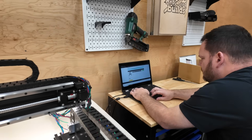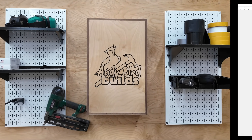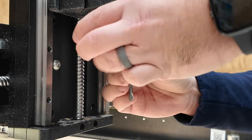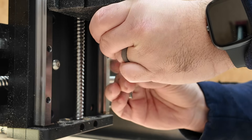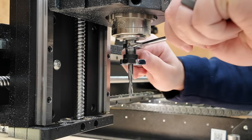Not just any double-sided tape will do — be sure to check out the material list in the description for the tape I recommend and all the other supplies I use for this project. Now let's look at the tool paths and bits. First, I've got a pocketing toolpath set to a max depth of half an inch. To keep things simple, I'm using just one bit — a quarter-inch downcut bit. The second toolpath is a profile cut done with that same quarter-inch bit, cutting all the way through the material to a depth of one inch. Total machining time is about 20 minutes — one bit, two tool paths. Let's get started.